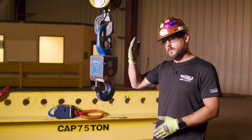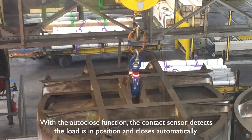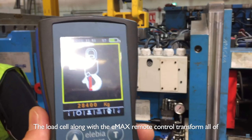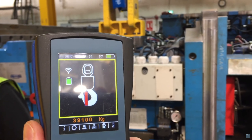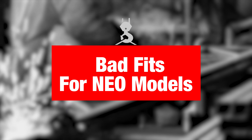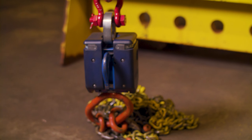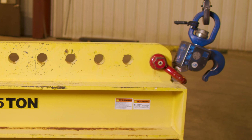The Neo is just a straight vertical — it turns up 90 degrees, whereas the Evo has a wide range. If you're anything over 25 ton, the Evo is not your go-to unit. Applications that the Neo wouldn't work with would be a chain sling laying on the ground — shackles that lay down would not be a good fit for a Neo. You have to have a hole opening; if you're lifting chain slings off the ground, the Neo is not going to be your unit.